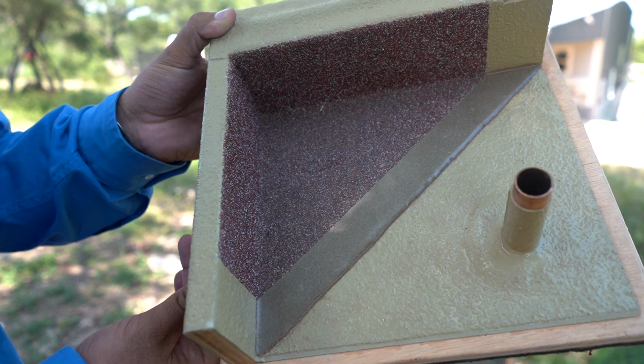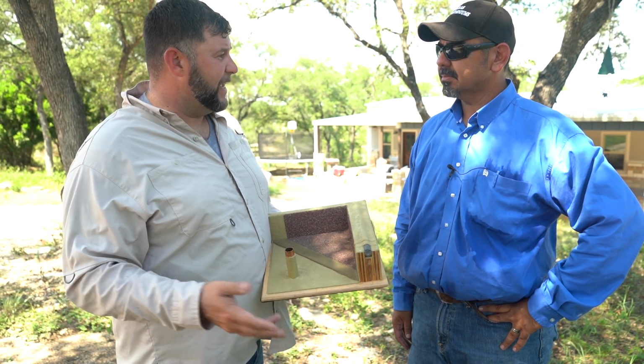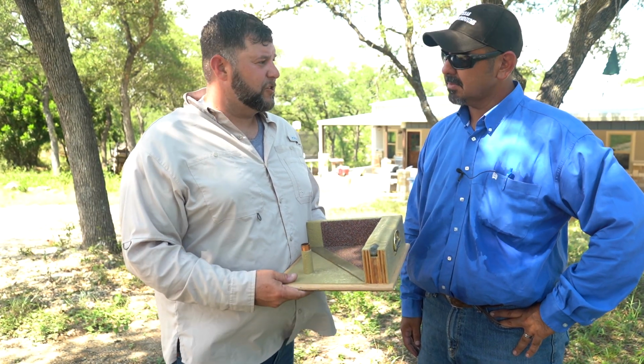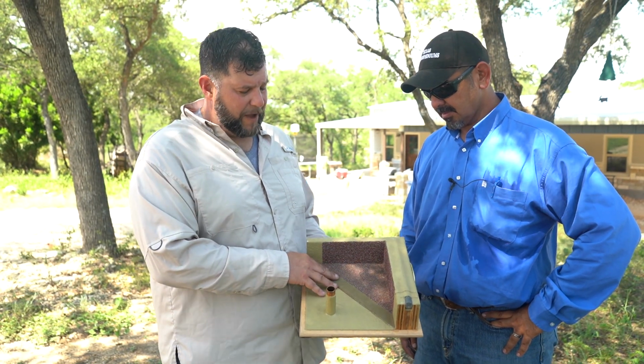Depending on your substrate, this is a wood substrate, metal, PVC, even some tie-ins with different single-ply manufacturers. But we have a primer selection chart based on your substrate. We're going to give you a primer, then come in with this fully reinforced resin. And then what you see in here is an optional traffic coating system.